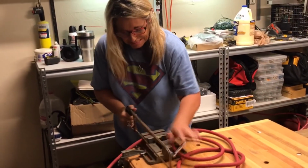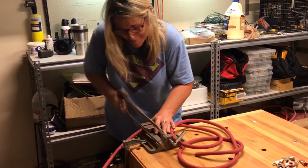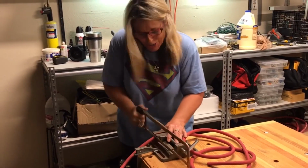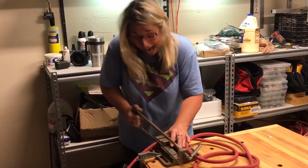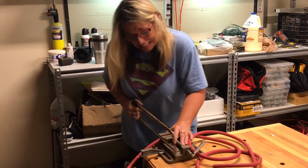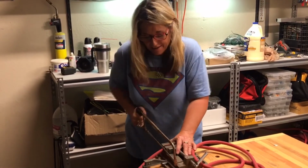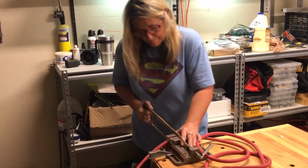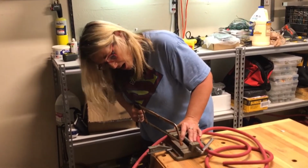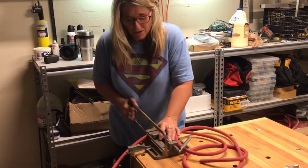Go, Robber! Fast as you. Nice long strokes. Oh, like that? Yeah. So going back and forth, is it good like that? Well, you won't cut as fast. Why not? Because you're taking too short a stroke. You're only using a small section of the blade to do the cutting. If you use the whole length, the whole blade cuts. Oh, I've always done like that when I've sawed things.